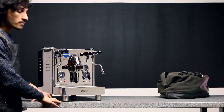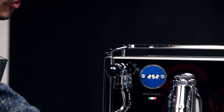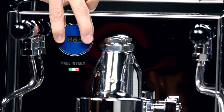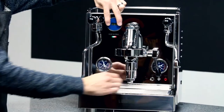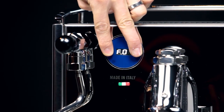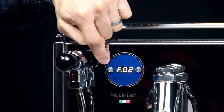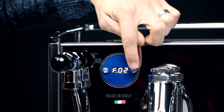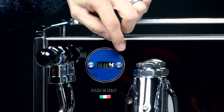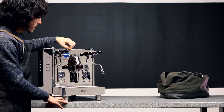There is an advanced setting where you can change the machine from 15-amp to 20-amp mode. The machine comes standard in 15-amp mode. To switch over to 20-amp, turn the main power button — the switch on the right-hand side — off. Press and hold the two buttons on the PID display, turn the machine on, and continue to hold until you see F.01. Press the left button once to get to F.02, and from here you'll see it's set at 4. That 4 is indicating 15-amp mode. If you enter and change that to 6, it will switch over to 20-amp mode.